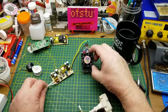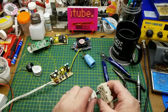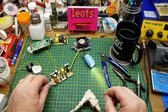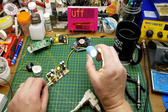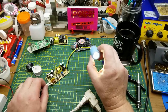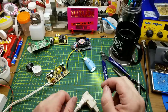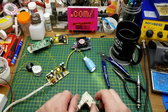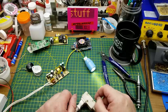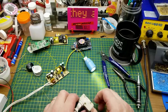This might just be a dud — these might be factory seconds. Pays your money, takes your chances. Plugging a small LED in shows it's trying but then shutting down. There does appear to be a bad connection somewhere, but it's not in my wiring. Something is going on in the output stage — it can obviously generate 5 volts but it can't sustain it. I'm not sure how deep I want to go into troubleshooting for this video, which was just intended to be a quick look at these little power supplies.